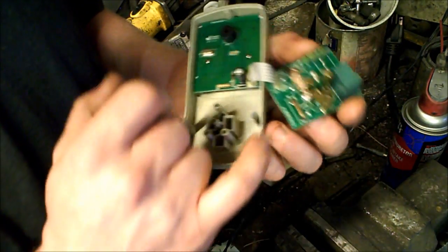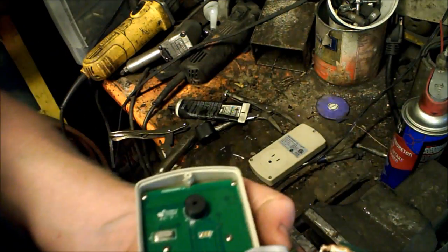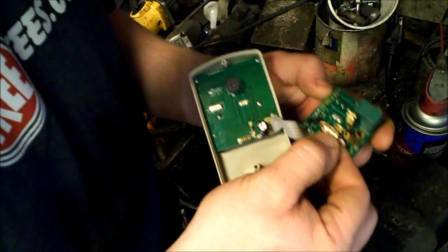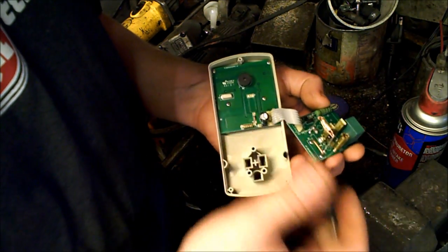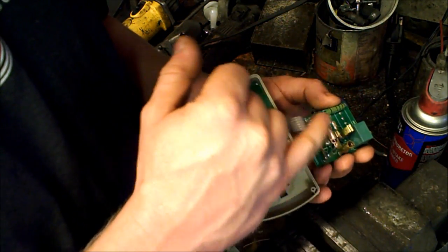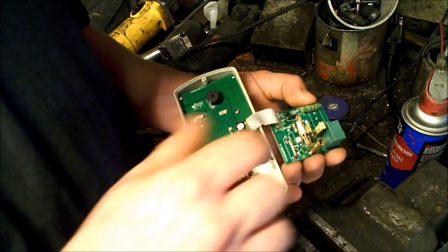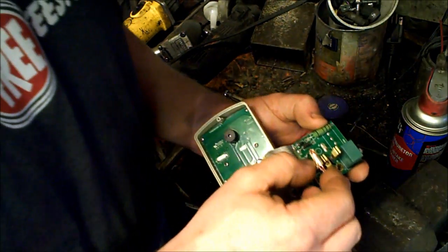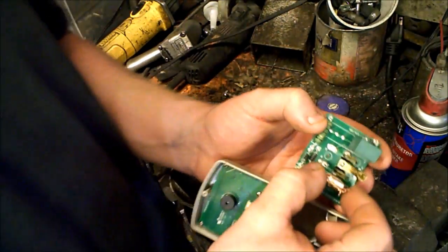Then I started looking and tried to figure out what this thing is. Turns out it's a thermal fuse. You can see that I got it wired to short it — to jump it. So anyway, that's a thermal fuse. I'm reading its ratings online and it actually says on the side: when that thing reaches 99 degrees Celsius it shorts out. And it's not like a circuit breaker — it's a fuse. So once it shorts out it's dead. I tested across there and there's no continuity.